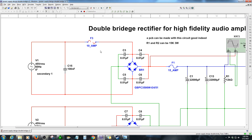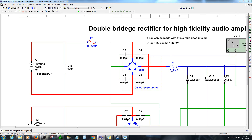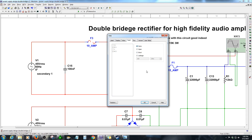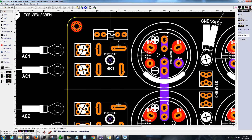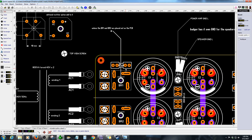We are simulating a damaged bridge rectifier with a short circuit - and yes, it blows the fuse. That is a safety feature the PCB should have in case the bridge rectifier goes bad, so you don't damage your expensive toroidal transformer. They are kind of expensive - you can spend $150 on a toroidal transformer - so it would be really sad to burn one out. That's why I place the fuse there: only one fuse per winding, and that's the one that will blow if something goes wrong.